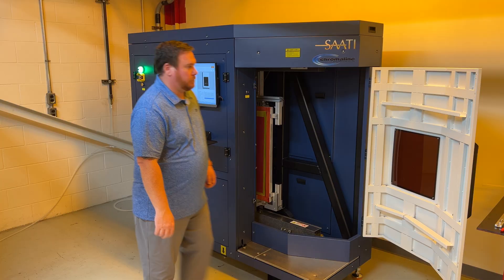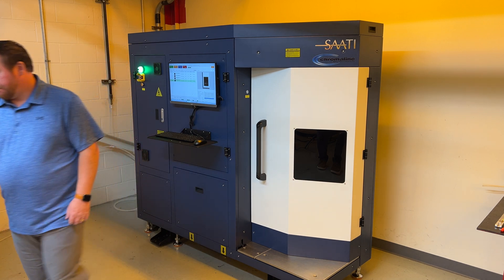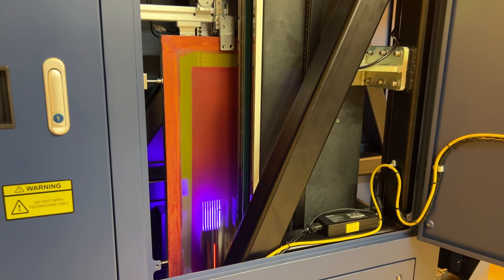The technology is a little bit different than what we use in the 6012 and 8012s. The LTS E70B uses an interlacing array of 64 lasers and an upgraded optical encoder to expose screens at 1270 dpi.